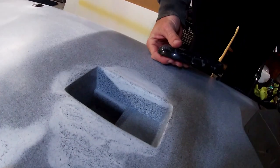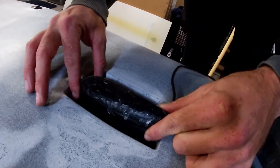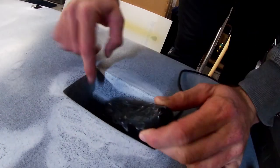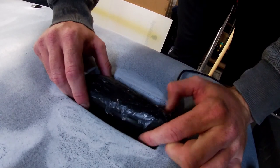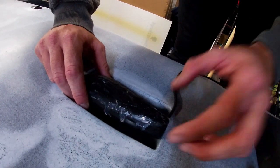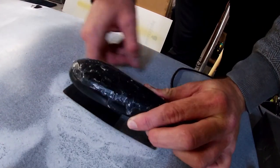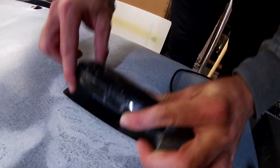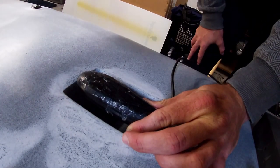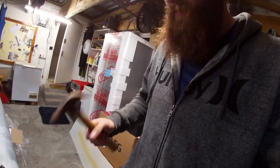So as you can see, the Garmin GT20 transducer fits but it doesn't go the whole way in. Your best bet is sanding it — we did that with Mornay's one — it just makes the plastic a little bit thinner. Edwin tried it out and it worked pretty damn well. You can also take a heat gun and a metal pole, heat it up, then put the warm metal pole there and mold the plastic so it's a little bit bigger. You literally need like half a mil. We're just heating the plastic to mold it a little bit with a hammer — not hitting it, just moving it, not burning the plastic.